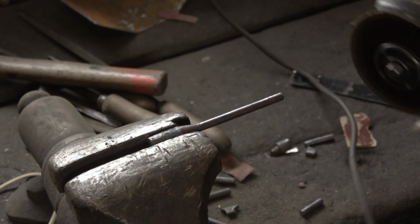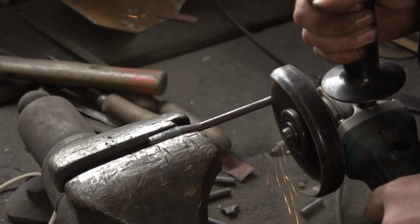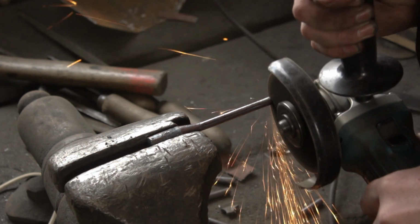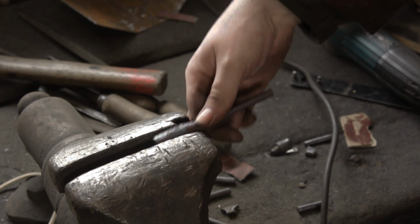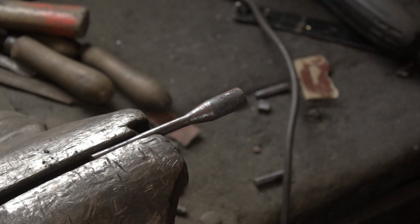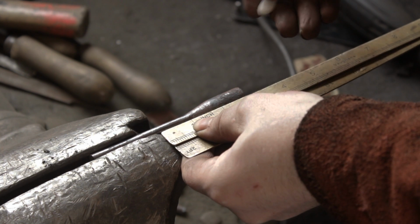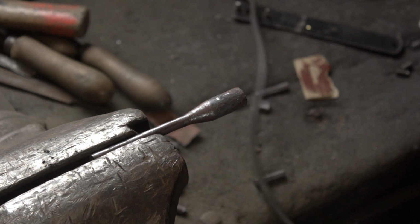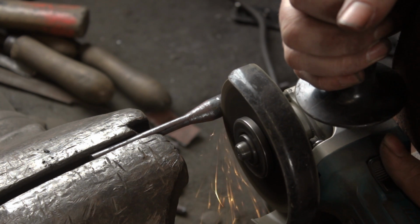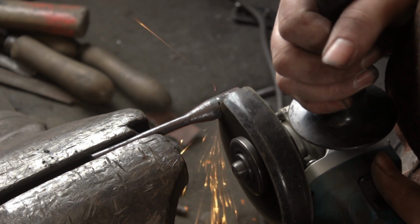And these things are just meant to be dropped into a countersunk hole and then bolted down from the other side. And pinned over a bit to imitate a rivet. Because there are lots of tourists around the aqueduct, canals don't really want to be doing hot works up there too much. So hence not putting real rivets in.